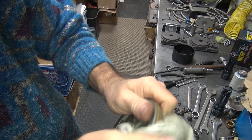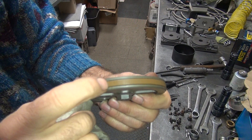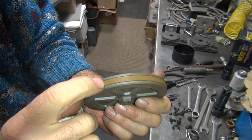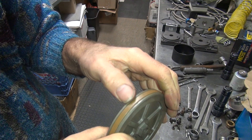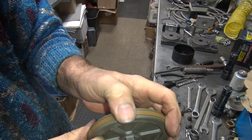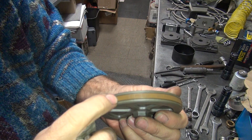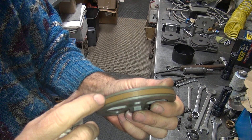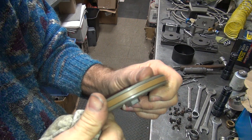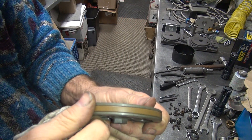I would think a little petroleum jelly on this stuff here would make it work a lot freer and easier, whether it's supposed to be coated or not I don't know. I can see a little roughness in here — see the scratches in there. That's going to be a leakage issue. It's got some junk in there obviously. So what do you do to clean that up? You don't want to put sandpaper on here because that induces grit into your surfaces which might never go away. Basically all I can do is wipe off the heavy stuff, then probably rub something across the surface to kind of burnish it in a little bit.